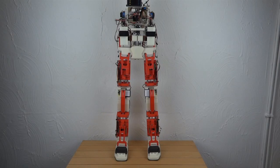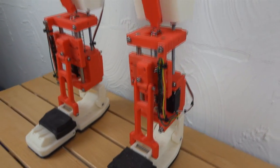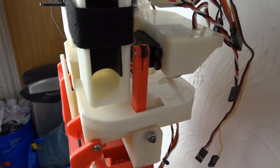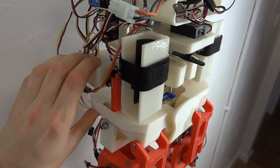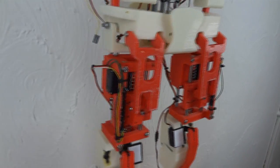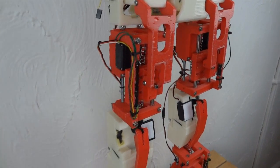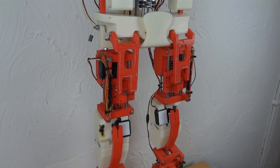So here's the whole Android together. Let's take a closer look at the parts — those are the ankle joints, those are the new thigh hinges which I've printed, and I've also printed these parts in red so all the new parts are red. Those are the new levers for the side-to-side motion of the hips, because the other ones had become a bit loose. On the whole, those actuators are incredibly strong — I actually hurt myself testing them by putting my finger in to see how tight they would pinch, which was a bit of a mistake. There's no doubt they will provide enough torque over the right level of travel to hopefully make it walk.